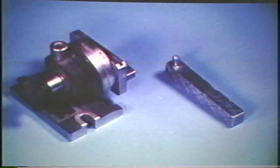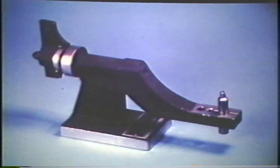Manufacturing situations which call for great accuracy require the use of precision truing or forming devices, or more specifically, precision diamond truing devices. One of the basic types is the angle dresser. Another basic dresser is this radius dresser. Examine it closely. You will see that it is basically a swivel and a base. With the swivel, the operator can make concave or convex surfaces.